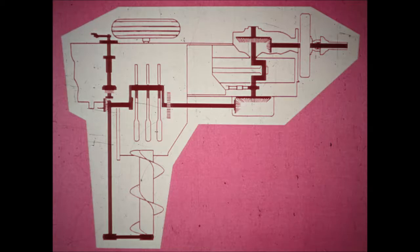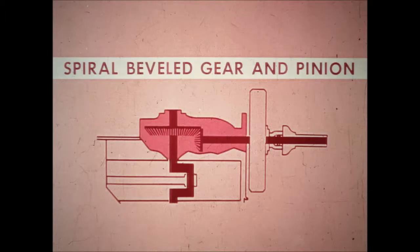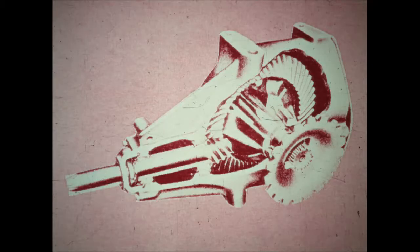The straddle-mounted plunger crank of the IH keeps the plunger pitman in proper alignment to avoid bending and breaking. New Holland's plunger crank is mounted on a single arm that creates angular strain on the plunger pitman and the arm mounting. The 37 and 47's powertrain is one big reason for their capacity to handle up to 17 tons per hour, day after day, season after season. IH power goes through spiral bevel and pinion gears to reduce friction and give more power to the plunger, increasing the baler's capacity. New Holland has a hypoid gear drive that by its nature has greater tooth angularity, resulting in more sliding action, more friction, and heat — limiting New Holland's baler to only 14 tons per hour.